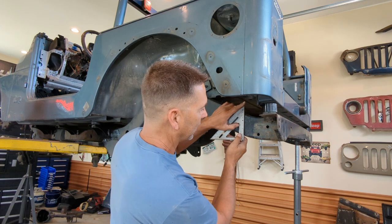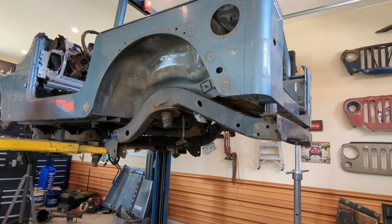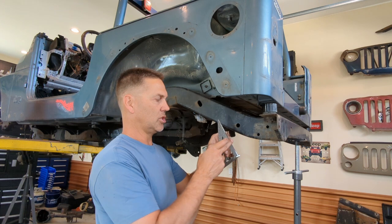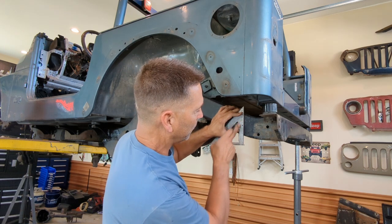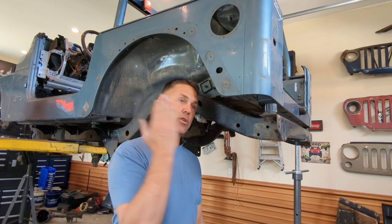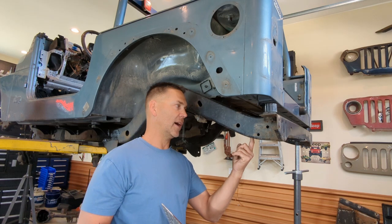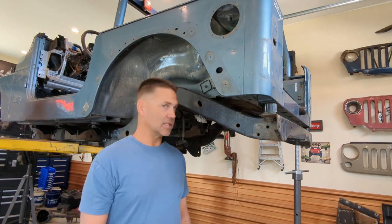That gives me a nice crisp starting line, then I just let the grinder work its way through. One thing to be careful of: when using a square like this, you'll eventually take material off the back side. Once you start taking off too much material, toss it and get a new one. Put the square on the line, start your cut, same thing on the bottom — start your cut on your line. When those cuts are made on a straight line, the cut on the back side will also be on a straight line, giving you a completely square cut.